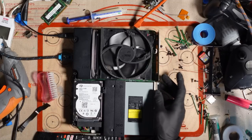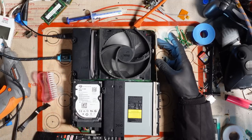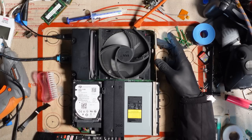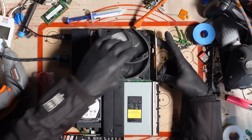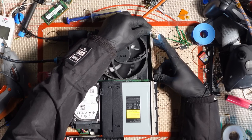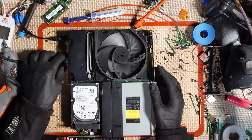And yeah, it's gone to a black screen. So after about a minute or two, it does go to a black screen as if it's trying to load it. We could try and load it into safe mode. So to load it into safe mode, I'm going to press the sync and power it on, and I'm going to wait for a second beep. Come on. It's not going into safe mode. Let's try... I'll flick that off. Let's try eject, sync and power. And then let's press and hold and wait for it to beep. Okay, that I think has gone into safe mode. It hasn't given me a second beep though. And it's not displaying anything.